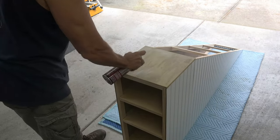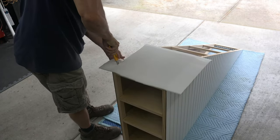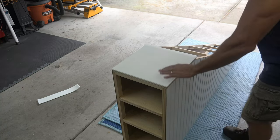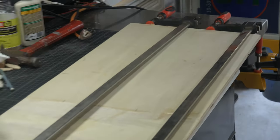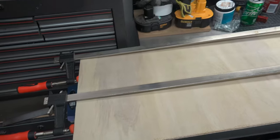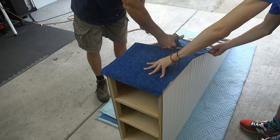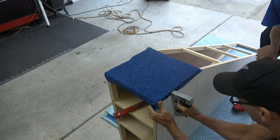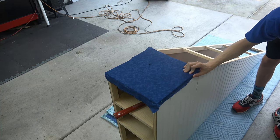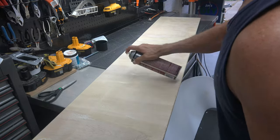Let's start on the ramp top. Get yourself some fabric padding — this will help the dog's feet sink in and get a better grip on the ramp as they run up and down. Spray some 3M adhesive on the top of the shelf box, lay your padding directly onto it, and after a few minutes trim away the excess. For the ramp top you can use one full piece of plywood. I used two pieces joined together with biscuit joints and glue to make covering with fabric easier. Cover the top of the shelf box first — if you did not attach the top to the box early, this step will be much easier. Cut your fabric to fit, pull it over to the back side, and staple down.